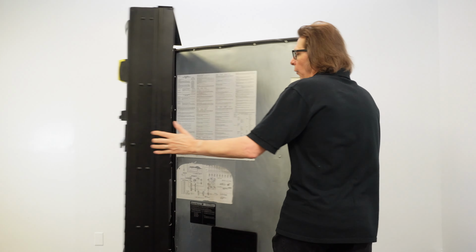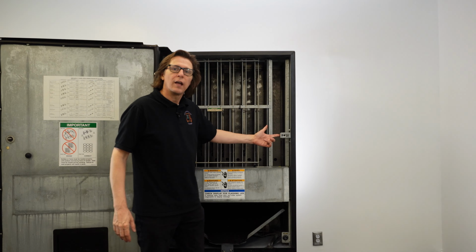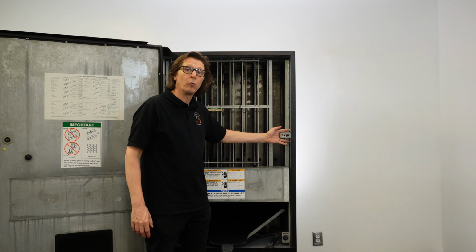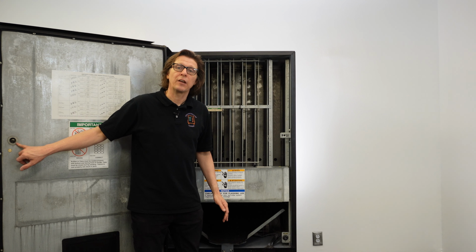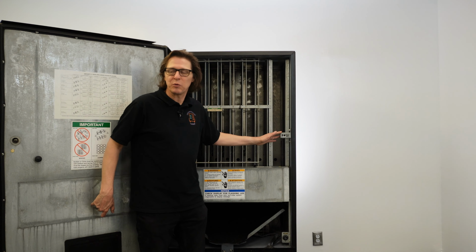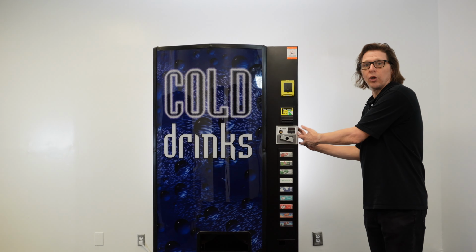And the problem here, again, is more than likely, keep this door open here, this nut assembly right here actually is not adjusted correctly. There are 3 bolts on this 501E here that allows you to adjust this nut assembly up or down to mate up with the T-handle shaft. Now, it can be a bit tricky to make those adjustments because how can you see where you need to adjust it? So obviously, when the door is closed, you can't see the nut.